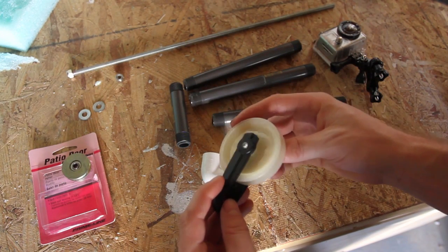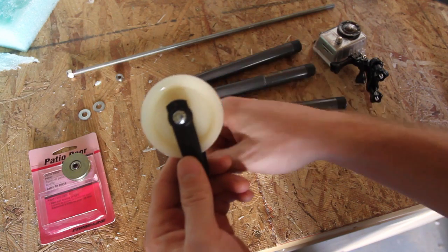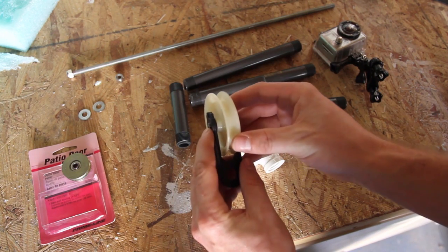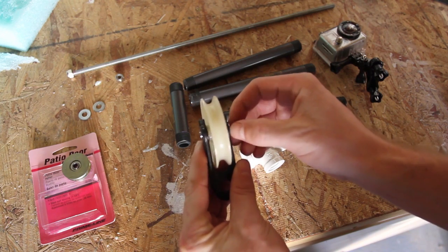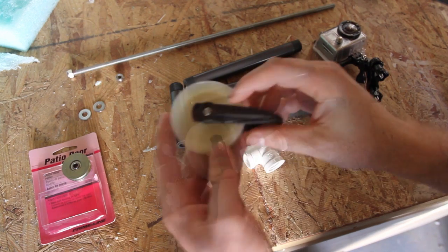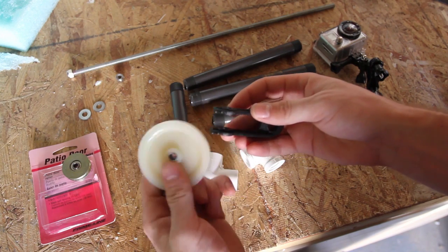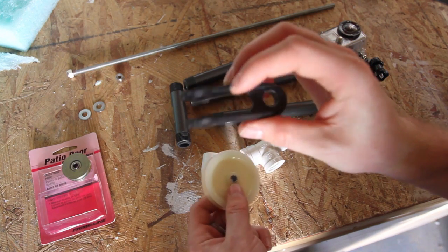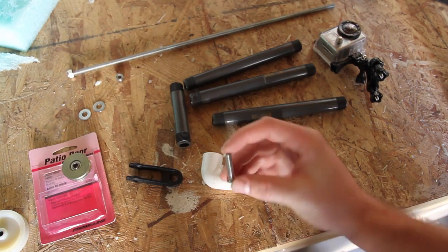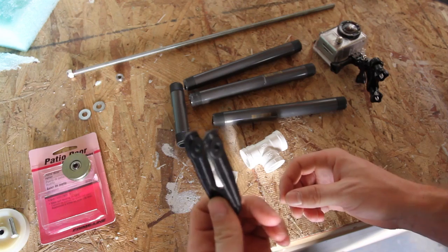The first step is putting together the wheel that's going to hang on the cable pulley. We're going to use this piece to hold the bearing wheel for the patio door. First you need to cut off the end of the through bar so you can pull it out and get rid of the pulley wheel — we only need the black plastic portion. Now you can see we've cut off the end of the pulley wheel, pulled the center axle straight through, which takes out the wheel. We're left with the plastic holder. You need to do this for both of your clothesline pulleys so you'll have two of these.